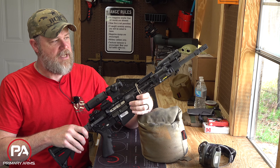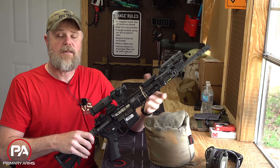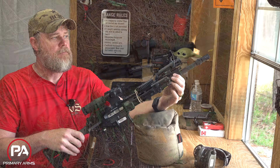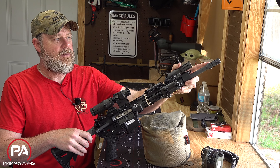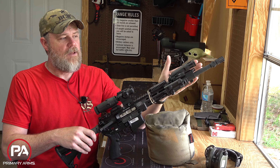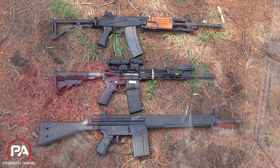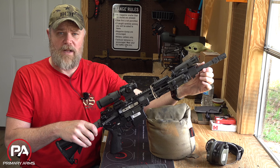It features LMT's quick-change barrel system, which pinches the barrel a full 360 degrees, holds it very tightly, and lets you swap the barrel in just minutes while maintaining zero with minimal shift. Moving out front, there's a gen 2 gas block — this is a short-stroke gas piston gun. On the end is a muzzle device intended for use with a GSL suppressor. The rifle has a 14.3-inch barrel, but because of NFA laws, the muzzle device is pinned and welded to meet the 16.1-inch minimum. The barrel has a 1-in-7 twist and is chrome-lined.